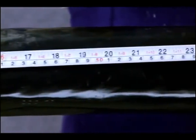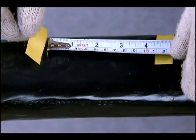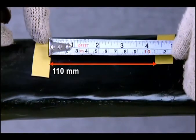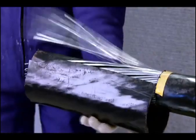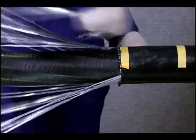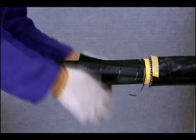On the right side cable, or the shorter end, measure and mark a length of 500 mm from the edge of the cable end. From this mark, measure and mark a length of 110 mm as the armor length towards the cable end. Ring cut and remove the outer sheath and armor from this mark. Mark a length of 10 mm from the armor edge for the inner sheath and remove the remaining.